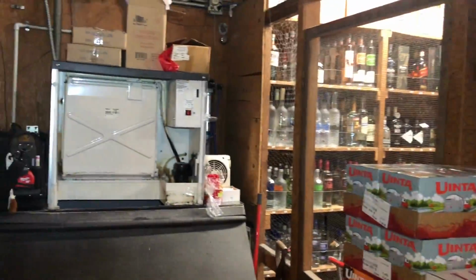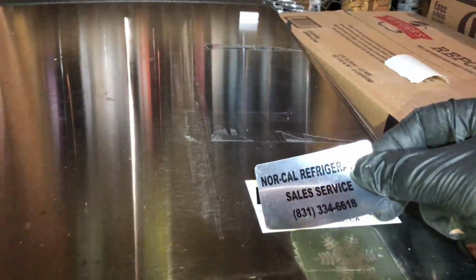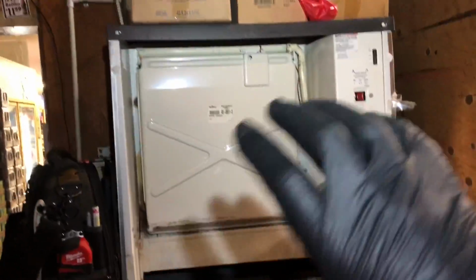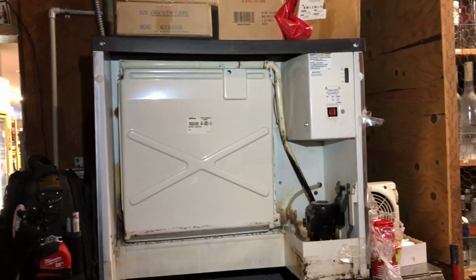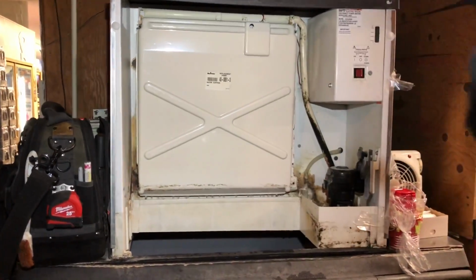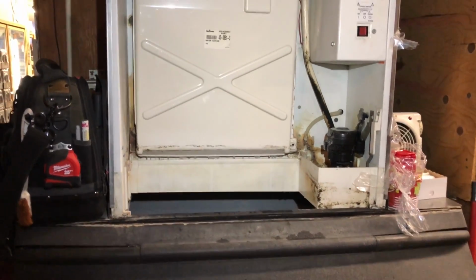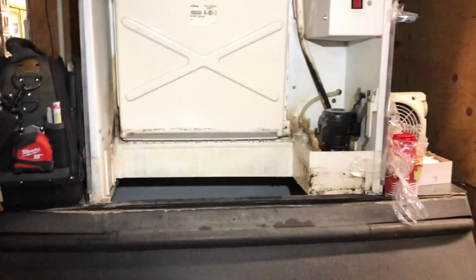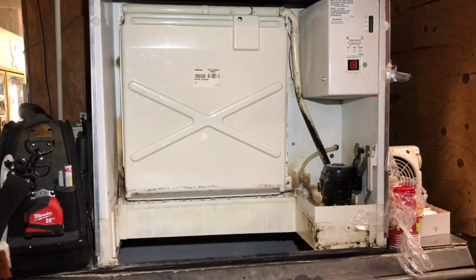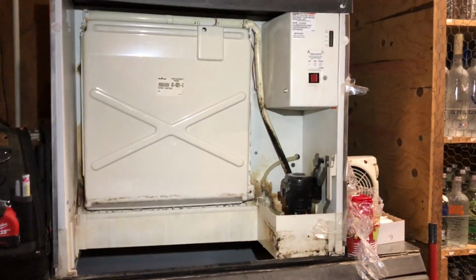While the machine's in the wash cycle for a half hour, you can put your sticker over the competitor's sticker. That's one thing we can do. And when you disturb stuff, for you new guys, the one thing that'll always get you if you don't check is the dump valve. So watch it make a couple cycles, check your water levels, and I always like to go over to the drain while it's in the freeze mode. About 10 minutes in or so, check your drain. If water's coming out of it, you got a piece of scale stuck in your dump valve, and you'll have to take your dump valve apart and clean it out. And that happens quite a bit. It's common. That's a good big heads up for you guys.